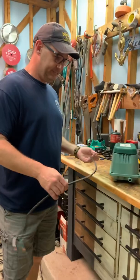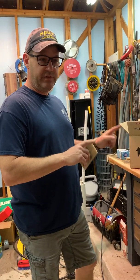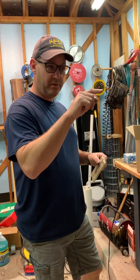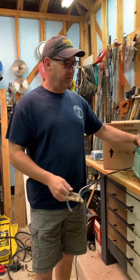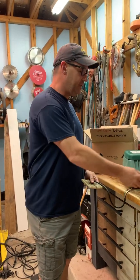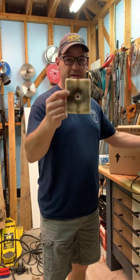What would you say the difficulty level is for the average person to do this job? On a scale of one to five, five being hard and one being easy, I'd put rebuilding the pump at a two — if you're comfortable with electrical work, because you do have to get into your control box and throw the breaker, making sure it's electrically isolated and safe to disconnect. That's another video. If you've got an eight millimeter socket and a Phillips head screwdriver, that's all you need to rebuild this — and 10 minutes of time. This is what that old filter looks like by the way, just to show you how gunky they can get.